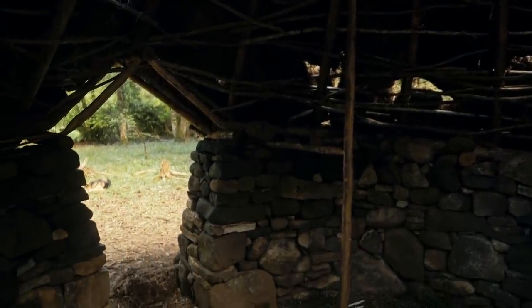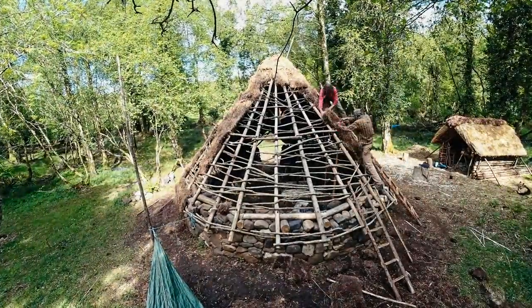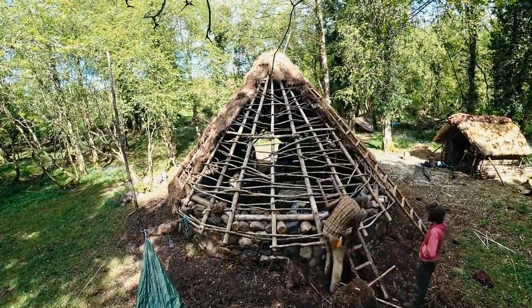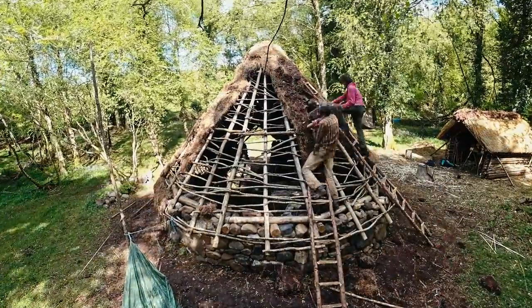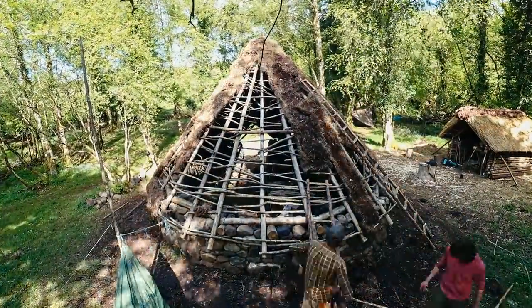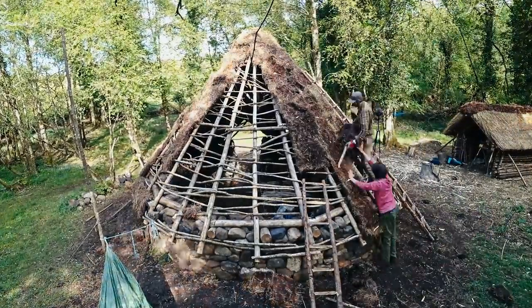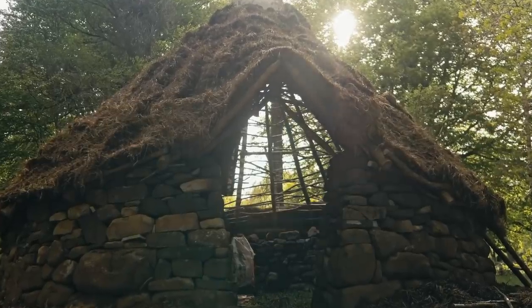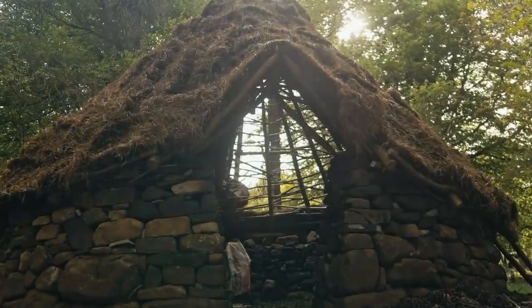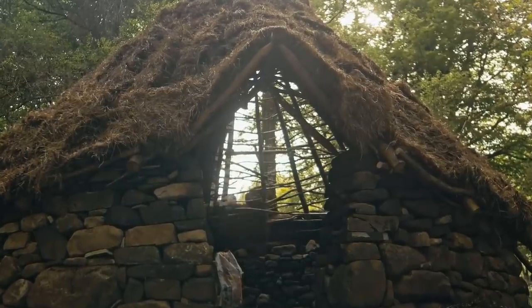Most historical references on scraw relate to their use on roofs of square buildings, where the scraw rolls were generally carried on top of the roof and then rolled down, reaching all the way to the bottom of the roof with a single roll. Our roundhouse roof is however conical, making the scraw laying a little more difficult. We were close to being finished already when we found the, for us, most effective way.